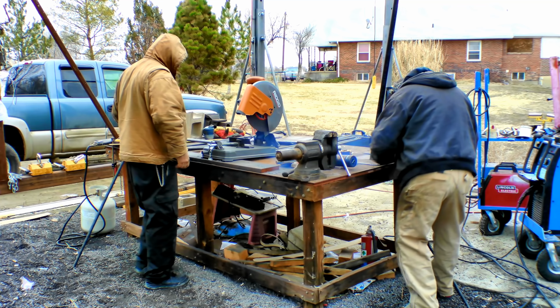And then there's a cutoff wheel on a grinder. That was pretty time consuming. It can be. I say a cutoff wheel, because my metal chop saw is the same thing, just in a bigger size. They each have their advantages and disadvantages. Anything that uses a cutoff wheel or a shear has very straight cuts. Downsides include, generally, you can't cut complicated shapes. It's one straight cut, done.